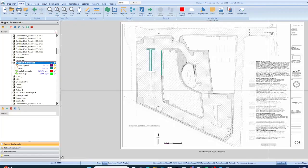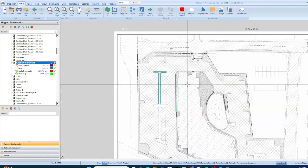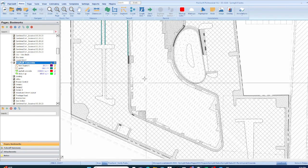So that's the walkways. So of course, this is the building. This symbol is the building pad, and the building pad is going to be in our foundation plan. So we don't need to measure that out while we're working on the civil set this week, but when we do the foundation, we'll be able to measure out the area, formwork, and then determine all of the rebar totals.